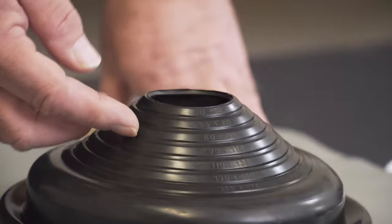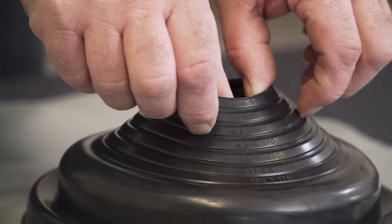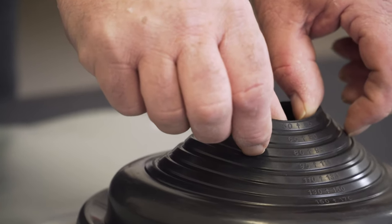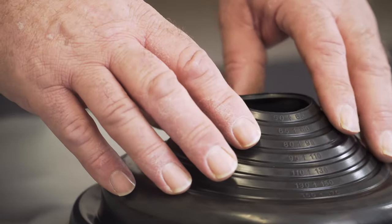After this, we recommend you absolutely do not cut it with a trimming knife, as any nicks that are created with a trimming knife will almost certainly split the Dektite as it's placed over the pipe.